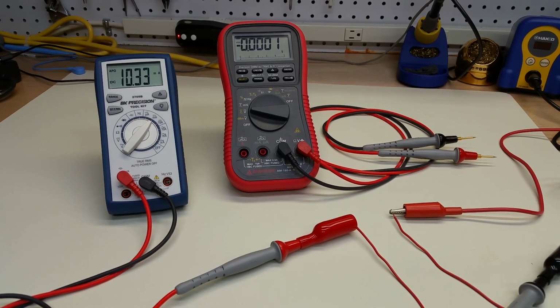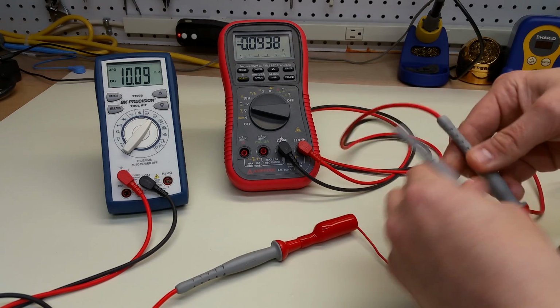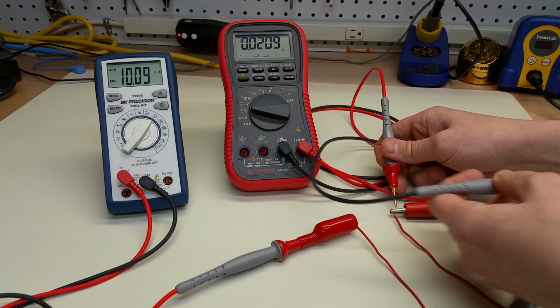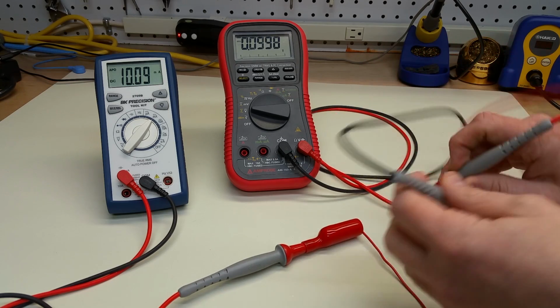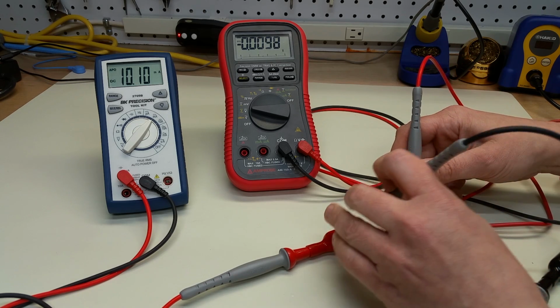Okay, and you can see that I can change the current by adjusting the current limiting pot on the power supply. And it doesn't matter what you pick. I'm going to set it for something as close to 10 milliamps as possible, because then you will essentially multiply the voltage by 100 to get the resistance in ohms. Now, with this meter, we're going to measure the voltage drop across the same resistance. So let's get the probe tips in here,